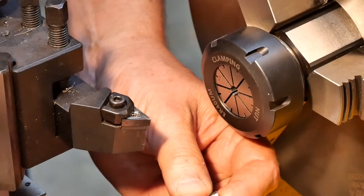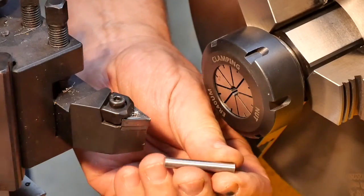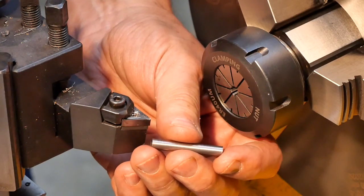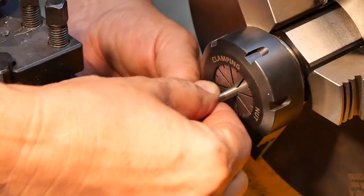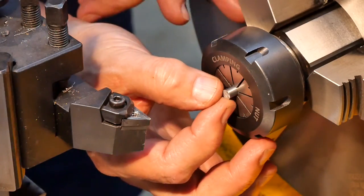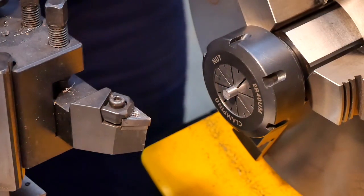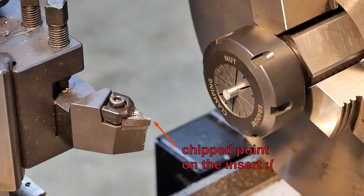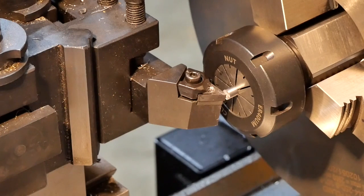I need four pinion shafts to do that, and I want them to be 37.2 millimeters long. I rough cut them to size, and I've faced one end. Now I've faced the other end and will bring them to length in this setup. So I've got a chuck backstop behind here, which is dialed in and set, so I can get my required length. So this is 38.4 at the moment, so we'll just take it down in a couple of passes.